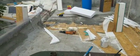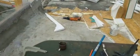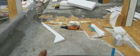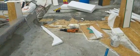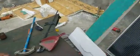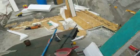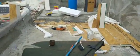So the first step up here for today on Sunday is to get that drain figured out. I got the fittings cemented together. Now I gotta cut the drain pipe back and then cut a hole around it to try to access it and get it down deep enough in there. And then after that, I gotta piece together the insulation pieces. And my goal is to get that plane flattened and three pieces of remesh on and mortared by the end of the day today. First up, the drain.